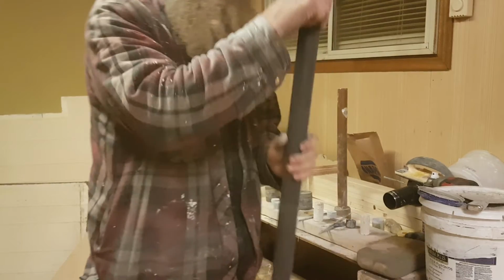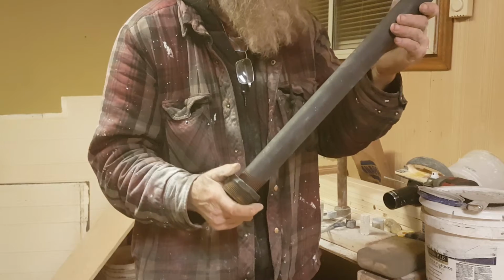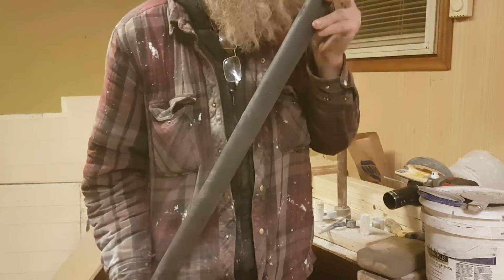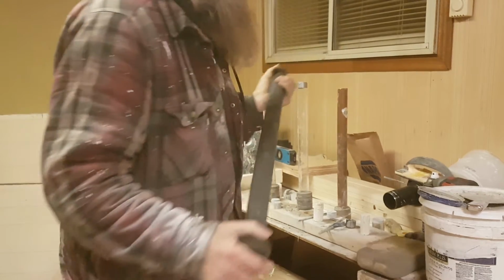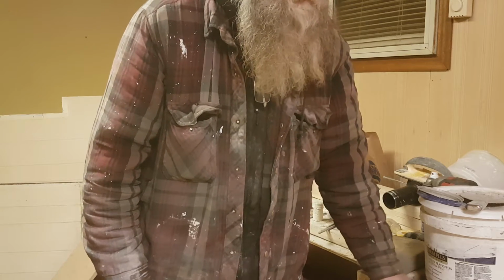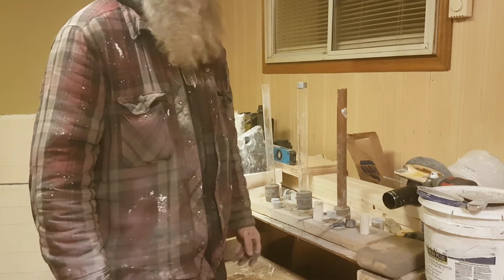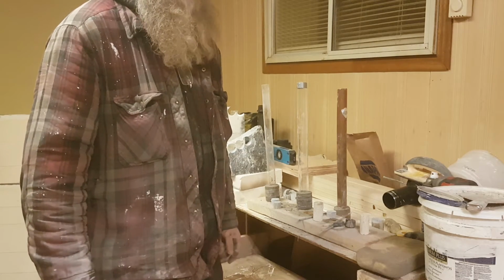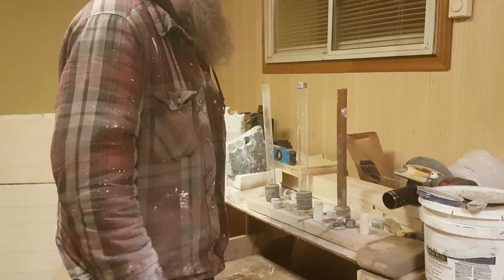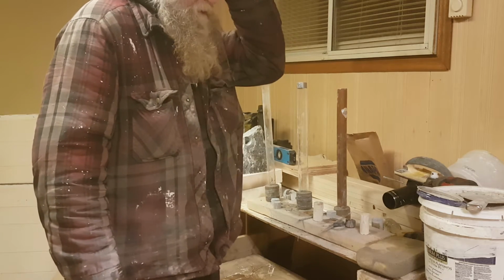I was able to actually fire up this little baby yesterday, and the pipe gets up to about 800 degrees on the end, and heating up fire brick, I got it around 1700 degrees Fahrenheit. In the summertime, doing the same test, I'm about 400 to 500 degrees hotter. Maybe it's because the moisture and the humidity in the air gets cracked into hydrogen. But in the summer, when it's hot and muggy, these things work the best.